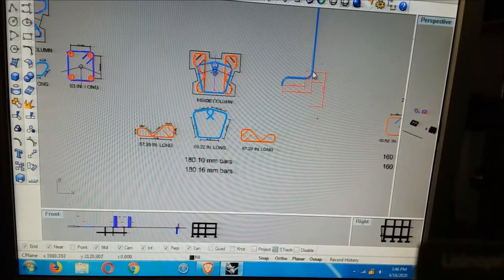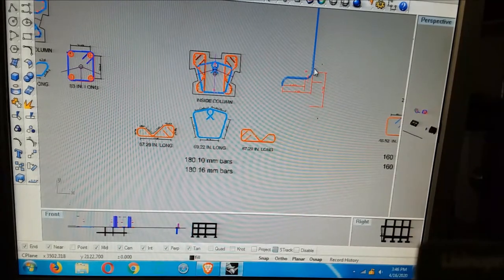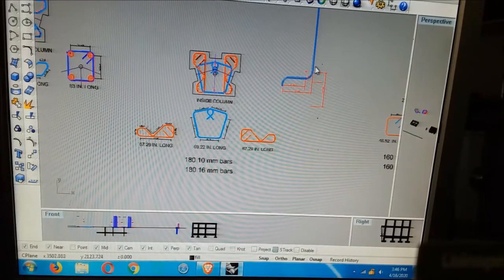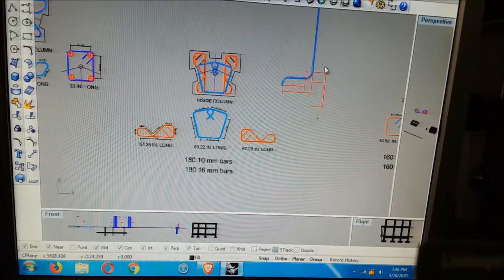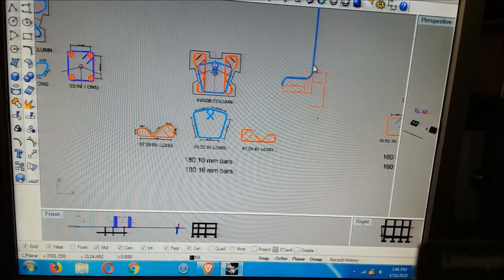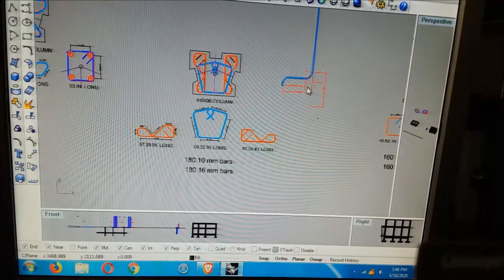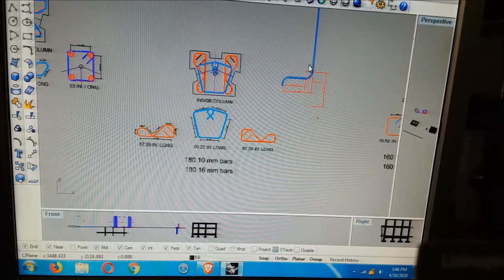And then we poured concrete up. I think it's only 12 inches. Could be 14 inches, but I'm kind of thinking it was intended to be 12. And what you do is put a tie wire around one of the bars with the tails hanging out, and then you put up concrete till that wire is flush with the surface. Anyway, the wires were at 12 inches, and that was one more chance of getting an even starting point for the house. Because if you had another half inch of this in the ground, but the top was at the right height set with the transit, which is how we did it with the optical transit.